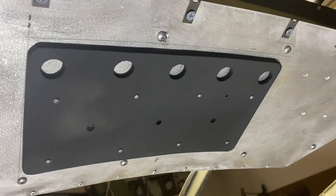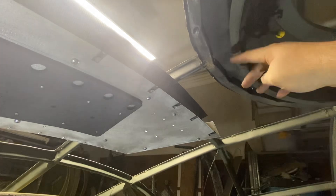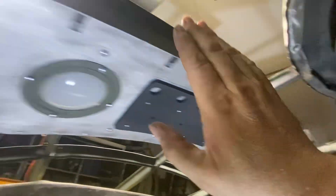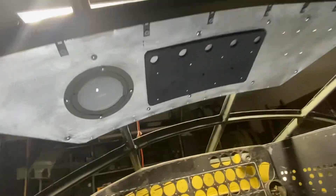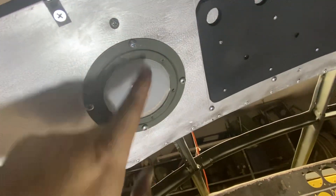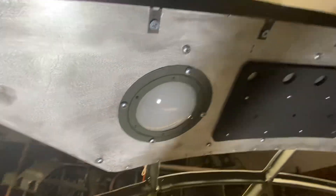Just tighten them up — otherwise it's going to look identical to the original. I've already got my speed nuts in here to accept the panel that's going to be circular, drop down, and then come around the sides. I actually think it's going to come around and be kind of flat here — you can't see it — so to kind of block these floods off yet maintain that ergonomic shape. This is positioned exactly how it is in the picture; it's kind of off where the picture is on all the B-36s that I can see.